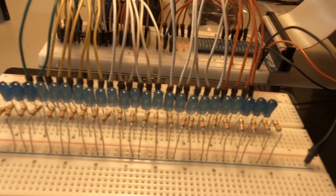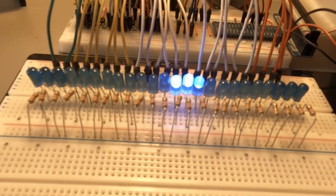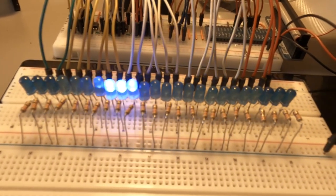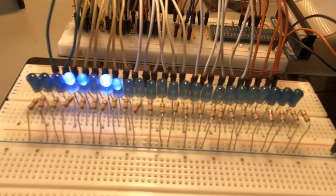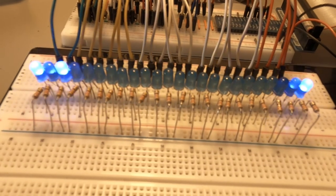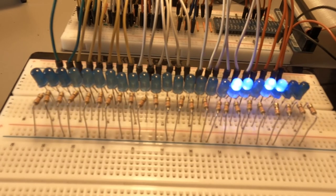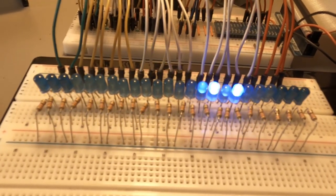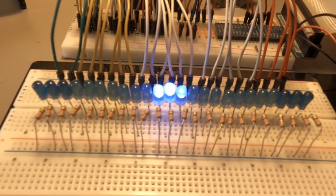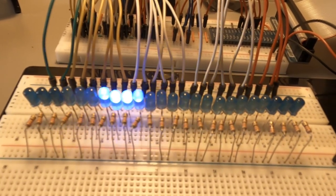See that? That's actually counting in binary. It's still counting in binary, but that's the true nature of the shift register. It's actually going from right to left. Without the sleep commands or anything like that, that'd be going like the blink of an eye. You wouldn't realize that it even pushed that far. But that's like watching it in slow motion. That's what the actual shift register is doing by nature. But because it's all three of them, it's acting like one real big one.